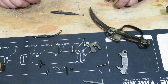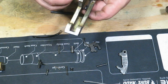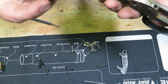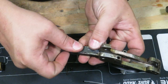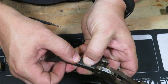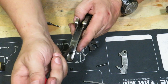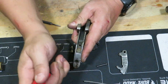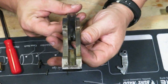All right, now we've got this all cleaned up and we're going to put this back together. We're going to start off just where we left off — we've got to put the ball back into our safety switch here. Just kind of drop that down, get it in the hole like such. Then, making sure this is in a downward position, push that in. You're going to line up those holes — you can see how that works. Just line up the grooves, press that in, get that down into that groove. Then bring that back in using a flathead screwdriver, pressing on that — be careful not to lose your grip and take out your fingers. Line that hole up, just like so. You can see how that went up and over the ball just like it's supposed to.